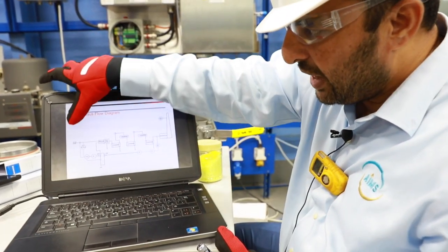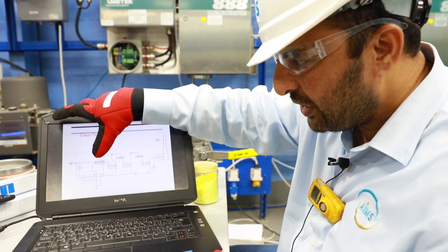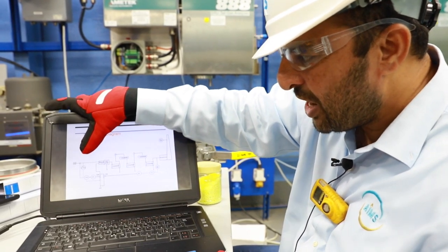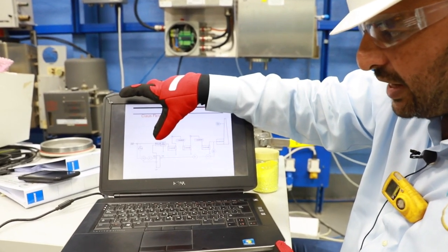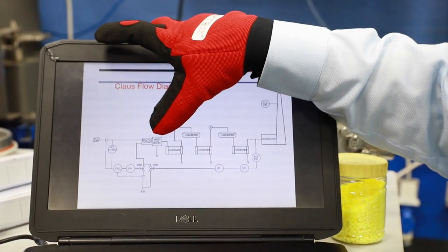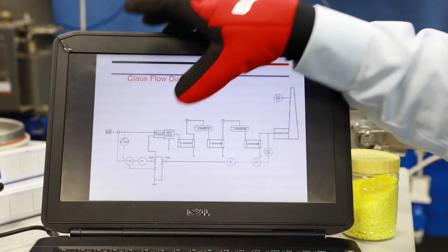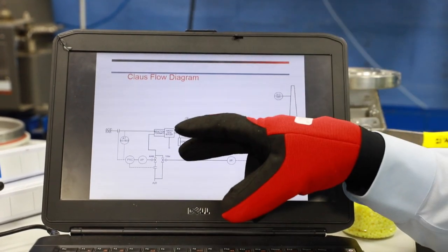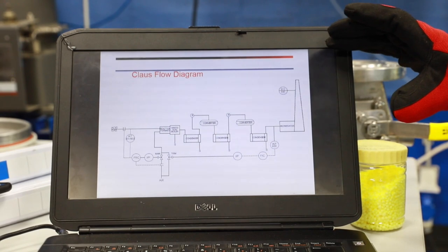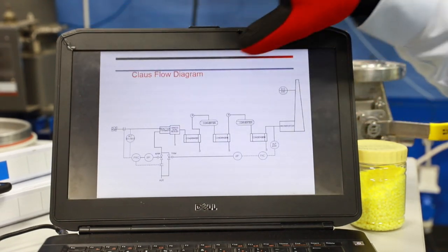You take the hydrogen sulfide gas and pass it through a reaction furnace typically running at 1,050 degrees C, between 900 to 1,300 degrees C depending on impurities in the acid gas. Since burning hydrogen sulfide is exothermic, a cascaded waste heat boiler takes out the heat. Water supply to this waste heat boiler generates steam, making the sulfur plant an energy provider that generates a huge amount of steam for tracing and other plant uses.